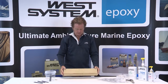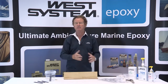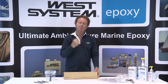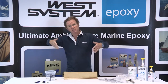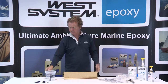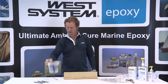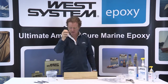Now, if you look at all of our other videos, you'll see that we mentioned two-step bonding as best practice. This also applies for fillets. Two-step bonding provides the most robust bond between the fillet and the plywood and consequently the two adjoining panels. Now we do that again by using our resin and hardener mix, a little glue brush, a mixing pot and one of our fantastic little plastic reusable mixing sticks.